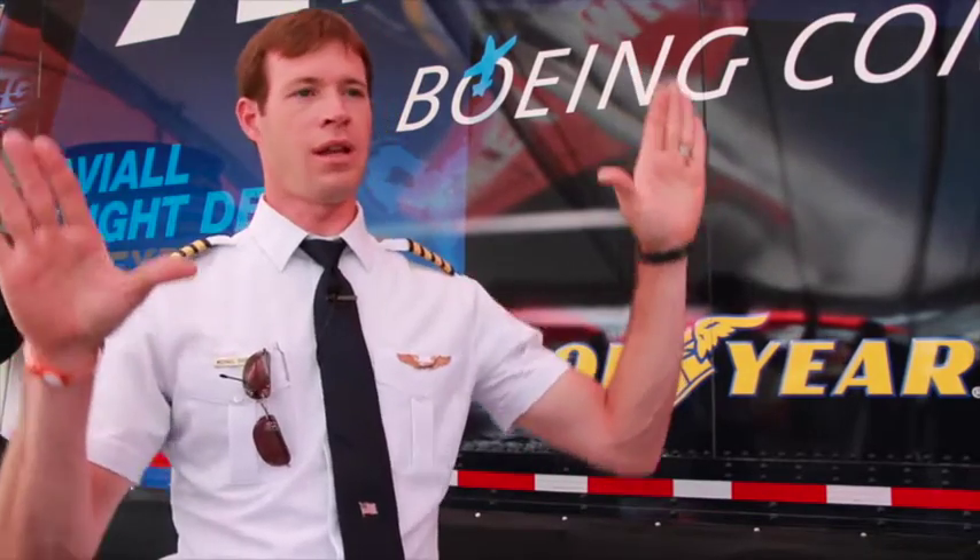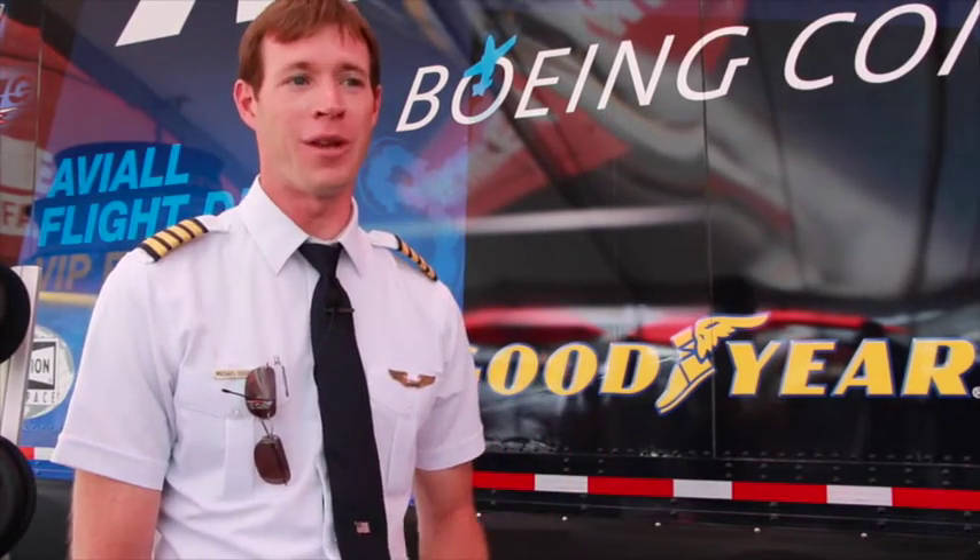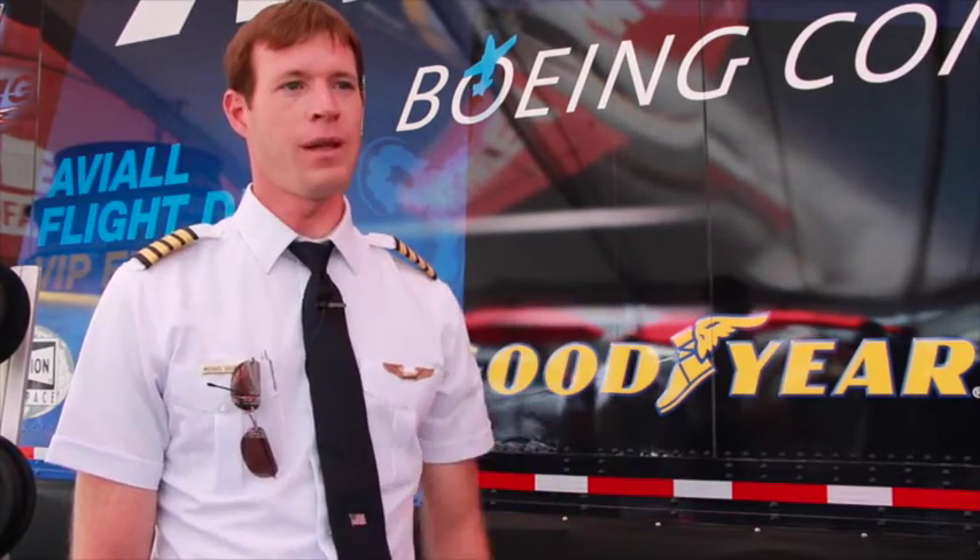We can also rock the ship back and forth, because as we're vectored 90 degrees up it's like a helicopter having two rotors, and as we increase and reduce power on each one, we can get it to rock — which is pretty cool. We'll demo that any time we have the ability to. The airship can also pitch its bow but stay in one place, which allows us to control the nose both up and down and left and right in still air without having the ground crew help us manipulate the airship.